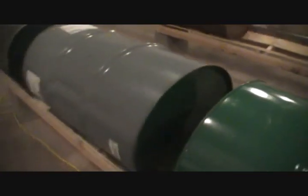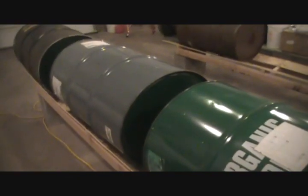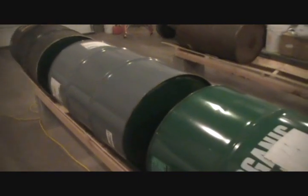And we'll wrap the back barrel with two straps, one at this lip and one at this lip, and then we'll put one right in the center of the middle barrel, and then we'll put two more on the front barrel. Now the front straps will actually work because we're going to fabricate a cone to go on the front here, and that'll give us something to weld that cone to, to help part the water, to break the water. And then the straps will also be used for weld points for our framework that's going to go on the pontoons. All right, so I pretty much told you guys all of that to show you.